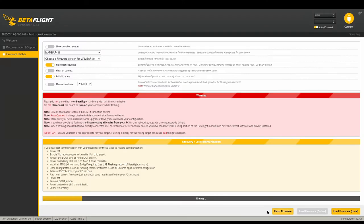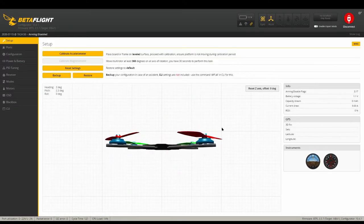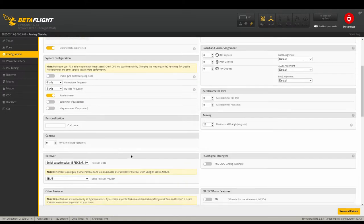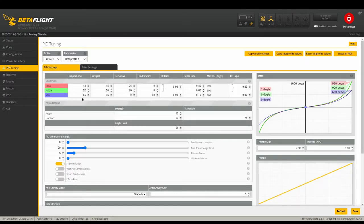I'm going to do a little bit of Betaflight setup right now. First, I had to flash some new firmware — I'll leave it in the description because it was a little bit hard to come by. First thing we're going to do is make sure that the gyro is oriented in the right direction, just make sure it's doing everything as expected. We have to turn IRC Tramp Telemetry on UART2, change the motor direction, set it to 8K/8K, and I'm also going to change it to DShot 600 because that's the way we roll. I'm also going to change the maximum arming angle to 180 degrees, and we also need to change the serial protocol to Crossfire. Now we can save and reboot on this page.